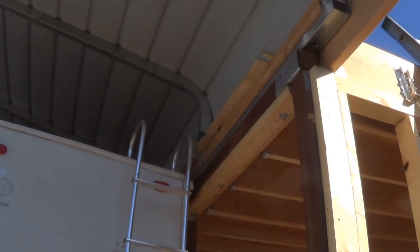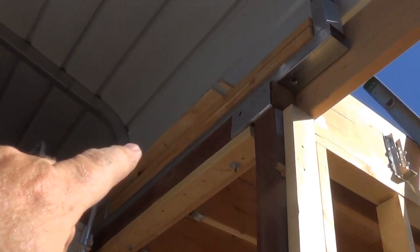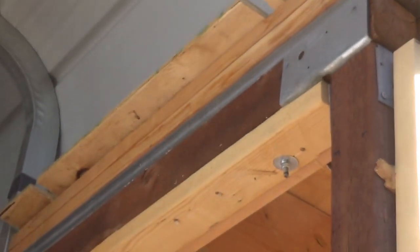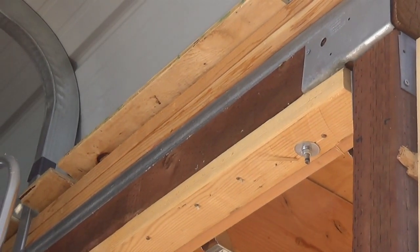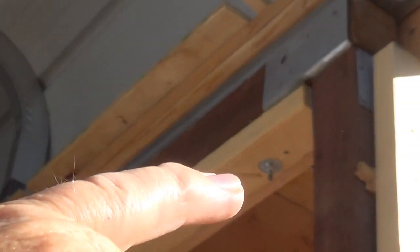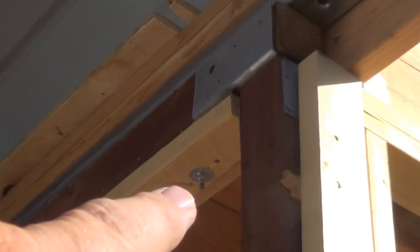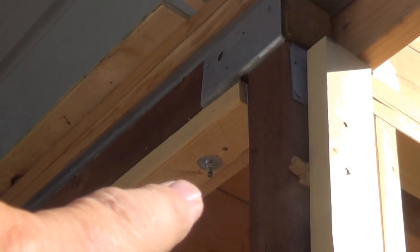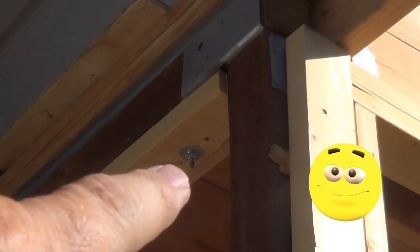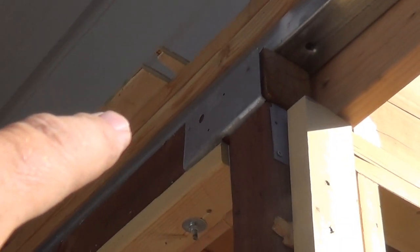and I put a 4x4 on there with a 4x4 post. Now, I did have to do some work because I used a 2x10. So from the back side, I added a couple of 2x4s on the top there, put another one on the bottom. I literally drilled a hole all the way through. I put a 5/16 all thread all the way through, and then put a bolt down on this end with a big washer and a lock washer, did the same thing up on top.